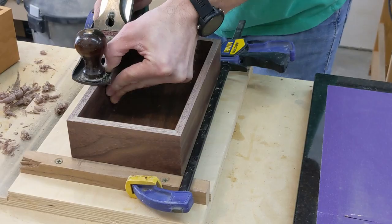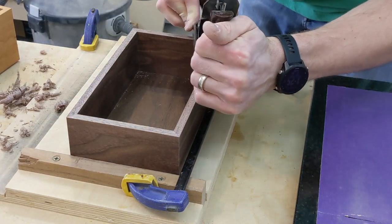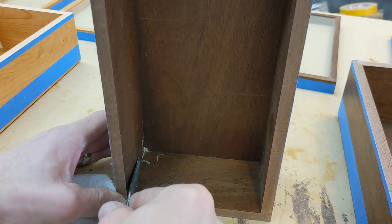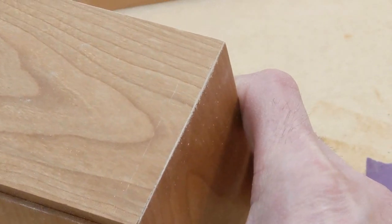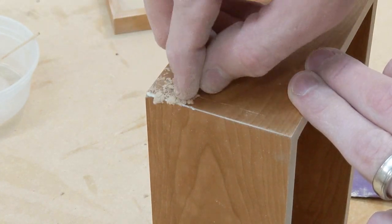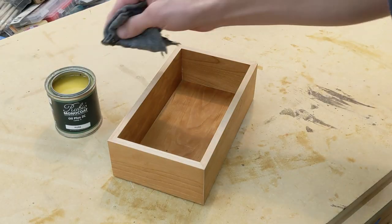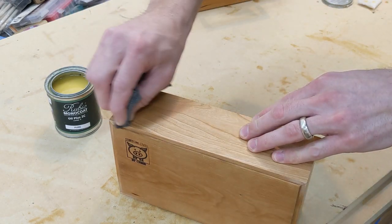Some cleanup is needed after cutting off the lid to remove blade marks left from the saw. I first used a hand plane to go around the top of each box and lid, then finished with a little sanding on a piece of granite I use as a flat surface. A big motivation for using Rubio Monocoat was the ease of touching up sanding marks and cut edges at this stage — simply wipe on a little more finish, allow it to sit for a few minutes, and after buffing off any excess, it blends in seamlessly with the rest of the finish.